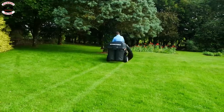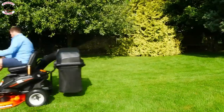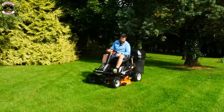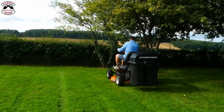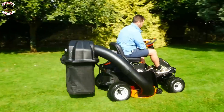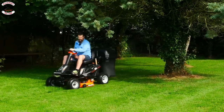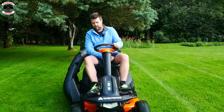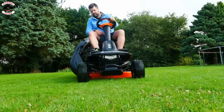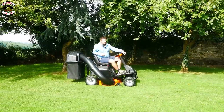Yard Force uses lithium iron phosphate batteries, commonly known as LFP. The benefits over other lithium batteries are longer lifespan, no maintenance, extremely safe, lightweight, and improved discharge efficiency. They have up to 4,000 recharge cycles — not the cheapest battery on the market, but due to the long lifespan and zero maintenance it makes for the best investment over time.